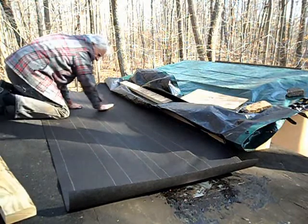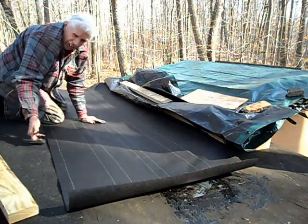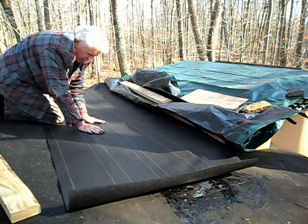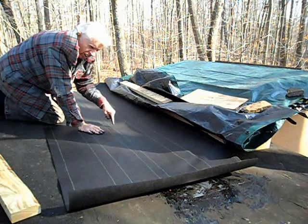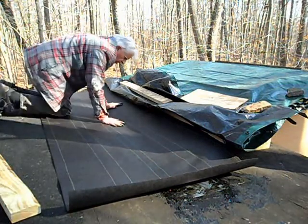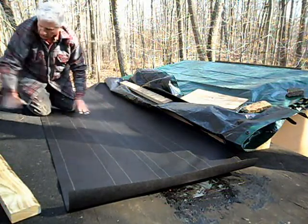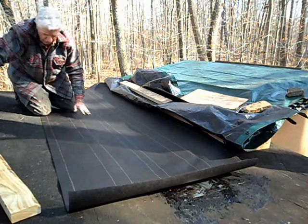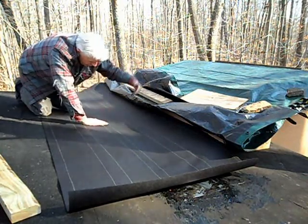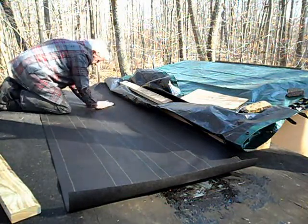This is why I'm no roofer. Now, naturally, you'd seal this up, this part. But we're not worried about that now because water's going to run underneath this. But I'm hoping the tar that I put in here on the flashing will prevent any water from getting inside. Because naturally, the roofing, when it's done on this side, will overlap. It'll come to here, and then the other part will come over here. There'll be a trough from here. That's it.